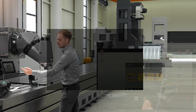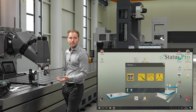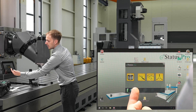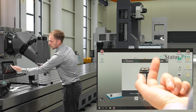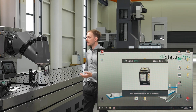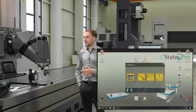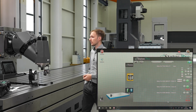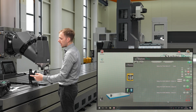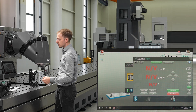We go to the software. We see here our so-called launch pad, and in the launch pad we can start the laser tool by pressing the button with the laser on it. In the laser tool we can adjust the laser so that it is nearly perfectly parallel to the X-axis we want to measure. So we want to measure a straightness, and we click straightness.